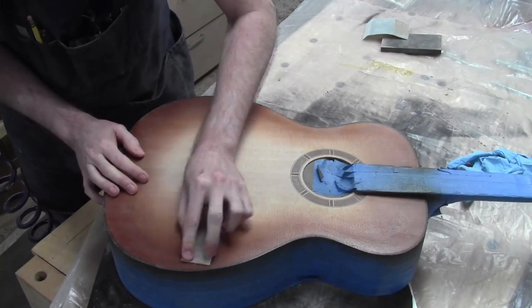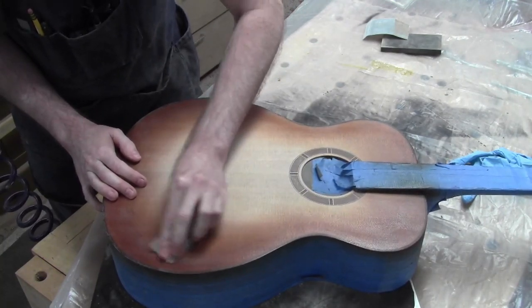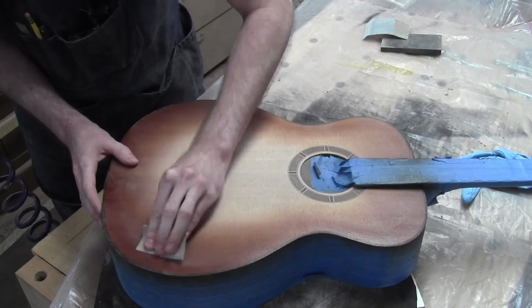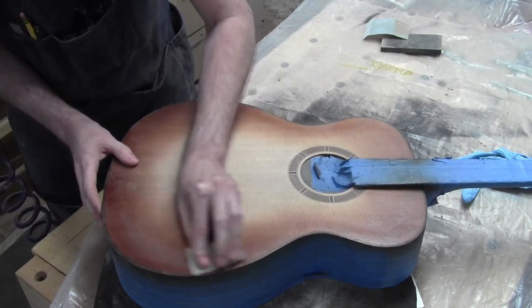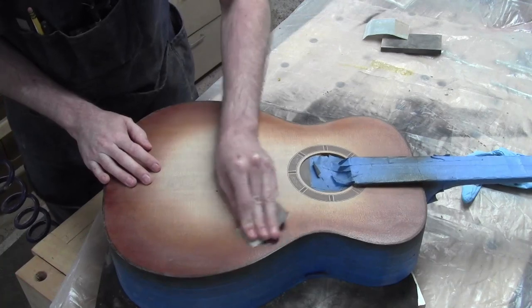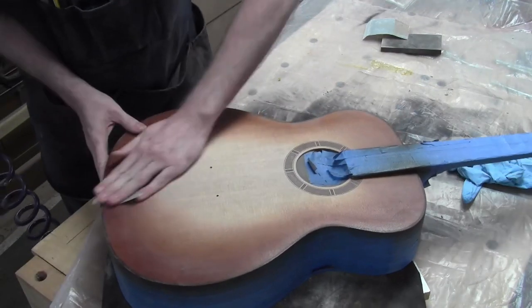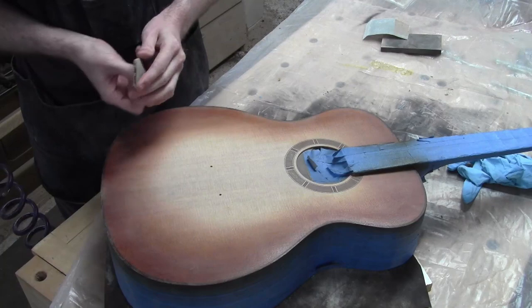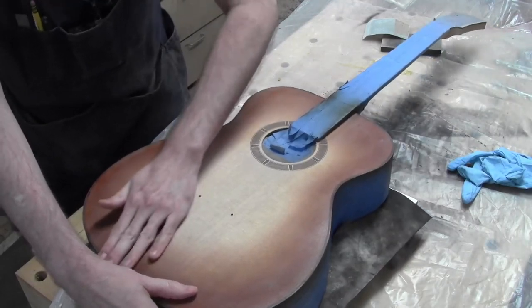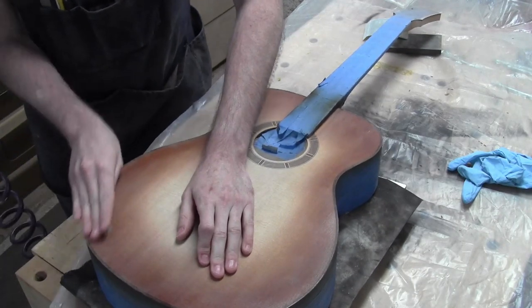I'm going to flip to fresh sandpaper and really zero in on that line area that's bugging me. Try to dial it back some, if at all possible. There's a bit of raised areas, so there's some light spots up here and a light spot right there that's forming, which I think are just high spots in the grain that my sandpaper's catching, which are good to catch now. And I'll mix up a tiny batch of color and touch those up just a teeny tiny bit, I think.